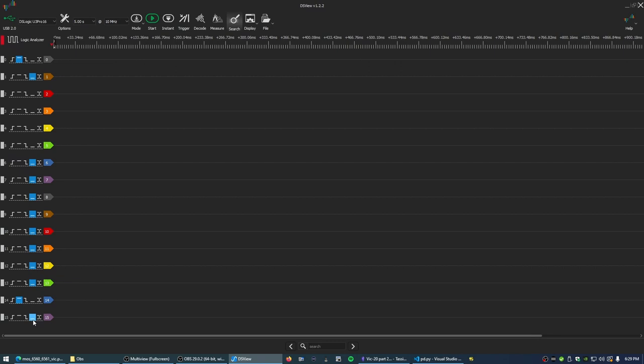Block 4 is block 4 bar, so it's active low. So when block 4 is selected, that's the memory between 8000 and 9FFF, which is where the VIC chip is mapped into.